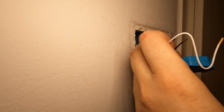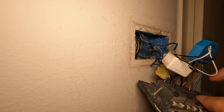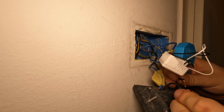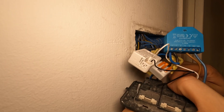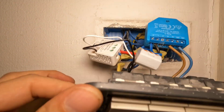The installation itself is really easy. All I had to do was cut the wires going towards my lamp in my bathroom, and then install the device on the existing live and neutral wires. Same goes for the smart switch sub-assembly. I removed the switch cover from the switches I have and installed it instead of one of the switches. The problem for me is that I already have a Shelly module there, so it was a bit of a tight squeeze, but it is working.